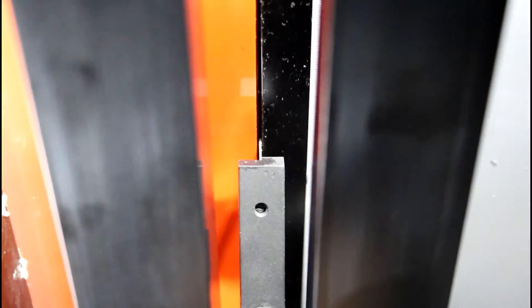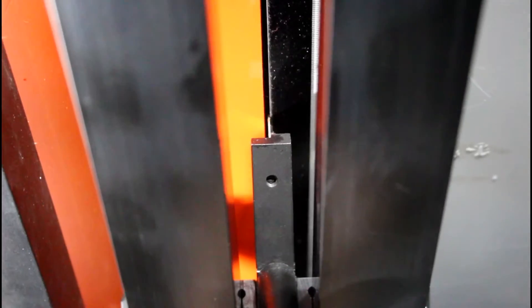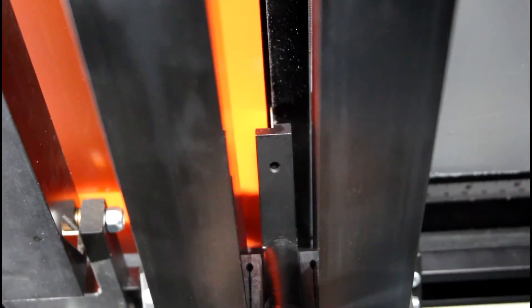Next, place a piece of factory glass — 20 by 24 or larger — on the left cutting bed. Raise the cart approximately 10 inches up from its resting position. Slide the glass toward the razor blade, leaving a small distance between the razor blade and the glass, maybe a sixteenth of an inch.